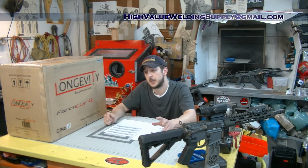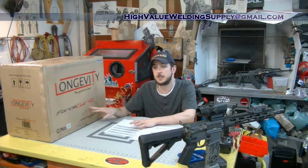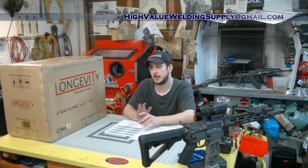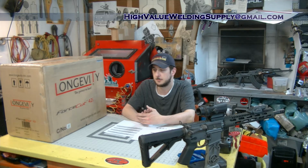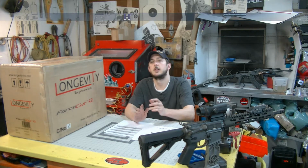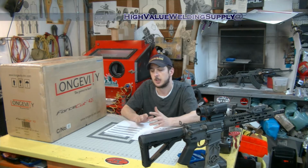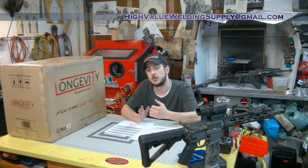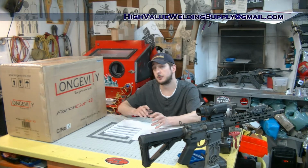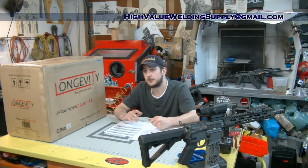It's blowback start, which is designed so this machine can be integrated with CNC, like a CNC table or whatever. The blowback start is different than high frequency start, and the reason it's good for CNC integration is because it doesn't give all of the feedback and the problems and interference that you get from the high frequency. It's actually a mechanical function that starts the arc, and it's able to use that to keep the arc going as voltage increases or decreases during a cut.